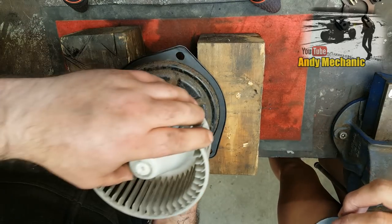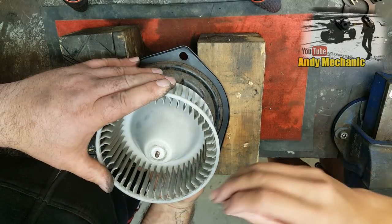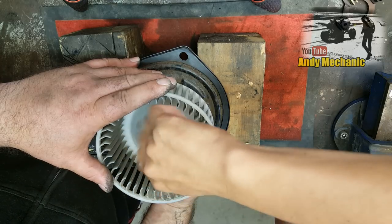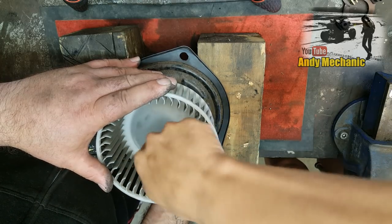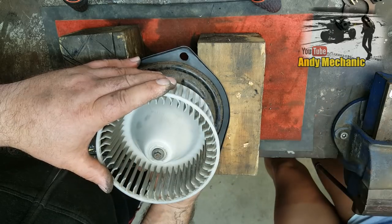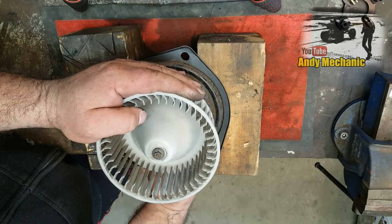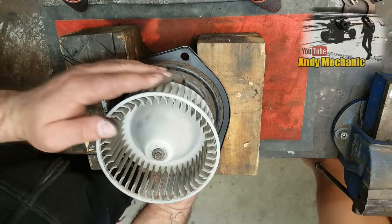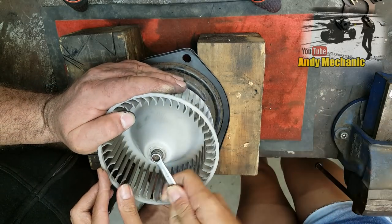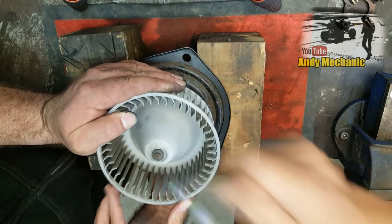We've got to line up the little flats. There we are, get that. You can pop the nut back on. Yep. It's a flanged nut. Yeah, it's got like a washer built into it. Now, remember what size it was? 8. Cool. If you grab an 8mm spanner then, and I'll try and hold everything while you give it a little tweak. Yeah, okay. Oh, there, look. It's got it in the right way, and we're going. That's it. Tight? That'll do. I think we're there now.